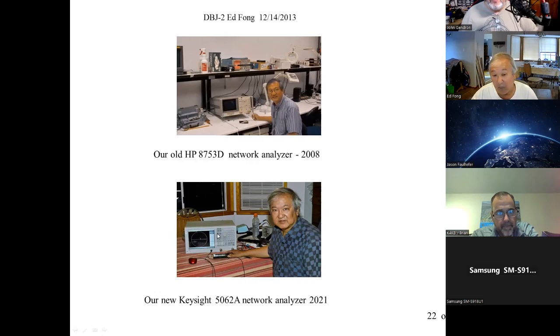So I open this up. When you open this up, it's a full analyzer, dedicated PC boards and everything. That's why it's so big. You open up this one, and it's a PC board right there. The instrument itself is this panel. It kind of unfolds. All the super expensive RF oscillators are within this panel that comes off. Then it's got cables going to the PC, and a hard drive. This thing comes up in Windows Pro, by the way. You hit an icon and then all the bright patterns come. Otherwise, you run it as a PC. We've got some testers that run on Google Android processors. They take advantage of the memory and processing power of a PC and ride on top of that.